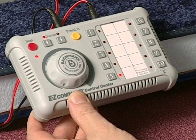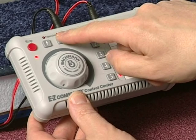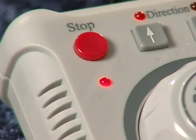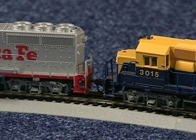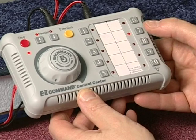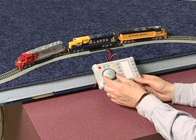If the number 5 loco was facing the opposite direction from loco number 2, press the right direction button — the right direction LED will light. Next, click the number 2 button. The number 5 LED will go off and the number 2 LED will light. The stop LED will now blink slowly and the direction LED will return to its original on position. The programmed locomotive will move slightly to indicate that the programming was successful. Now press and release the stop button again — the stop LED will change from slowly blinking to being on constantly. Repeat these steps to program locomotive number 7 to the locomotive number 2 address. All locomotives in your consist will now react to address number 2 and run simultaneously in the configuration you have programmed.